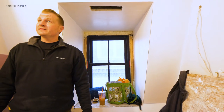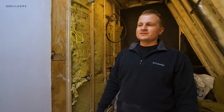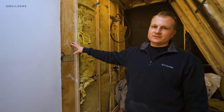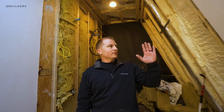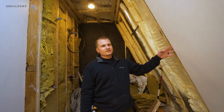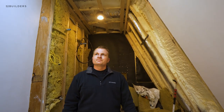Final patches on some of the plaster are going through with fine sanding — they're actually sanding with 400 grit right now and filling with a little bit of joint compound, using a light and checking the walls to make sure everything's perfectly smooth. Once the plasters are wrapped up in here, we're going to start prepping our shower stall. We'll waterproof this using the Schluter system. There's going to be a glass door with a transom up above because it's a steam shower, and then a piece of glass on the side that gets notched around our bench. We'll use the tiled-in glass track like we do on most jobs — a nice clean floating piece of glass detail.